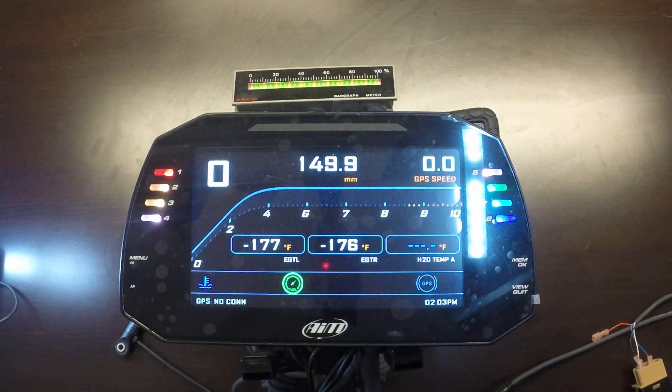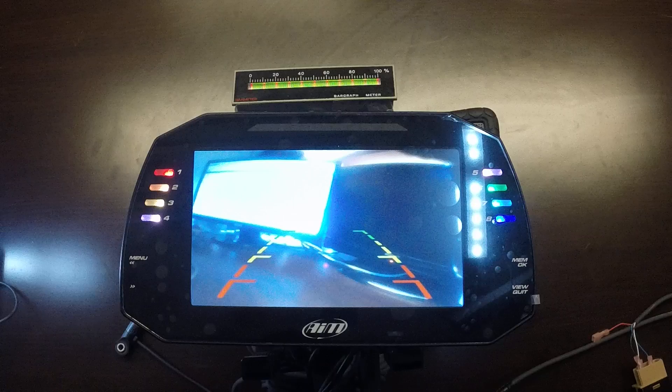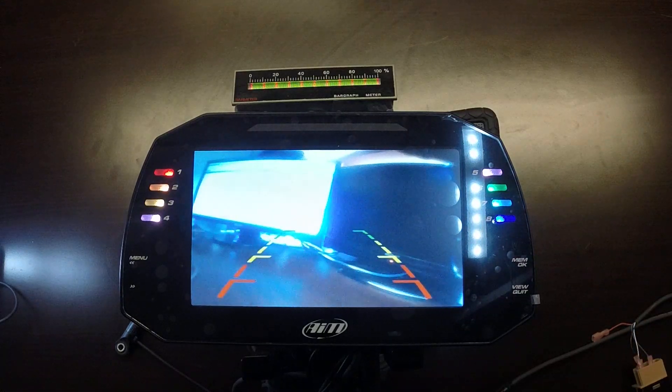I can simulate that here just with a simple push button on the steering wheel to trigger the rear camera. We can obviously trigger the camera like that. So that allows you to have access to a blind spot camera, or you can wire it into the reverse lights of the vehicle, so that you can simulate a vehicle's infotainment or dash system.